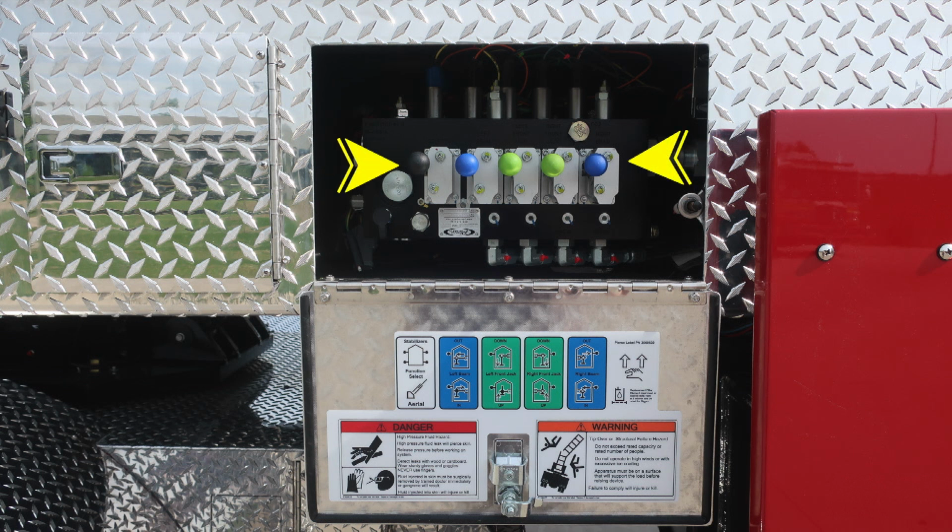Let's move further back for your overrides. You can see that the activation device at the very top section, valves, do match the lower section on the instructions here for indicating each one of those valves and its direction and position. As we move down, we do have a danger regarding high pressure hazard because of those hydraulic lines, and then also once again a tip over hazard.